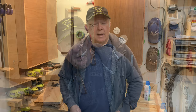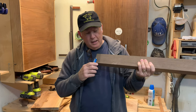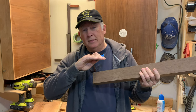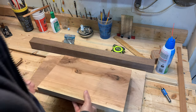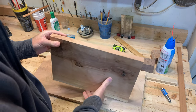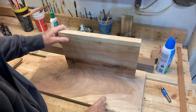So what I'm going to do today, I'm going to experiment with two features. I'm going to take this wood that looks like wenge and create some beads on it as a sample to attach on the bottom of the table to give it a little accent. Then in a second experiment, I'm going to make a bead on the bottom edge of the tabletop itself to see how it looks and decide which one I like better. Since this is an experiment, I don't want to cut my actual tabletop, so I have a stand-in sample piece of pecan cut from the same log, the same thickness, to use as my edge design test before committing to the actual tabletop.